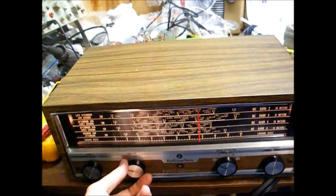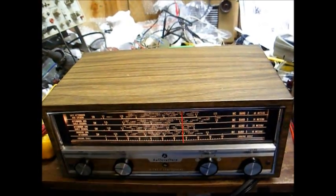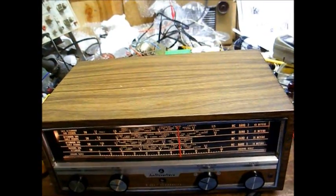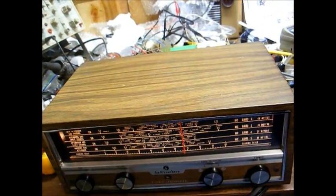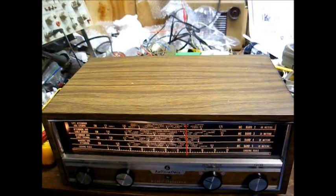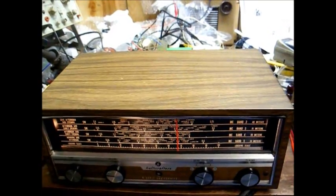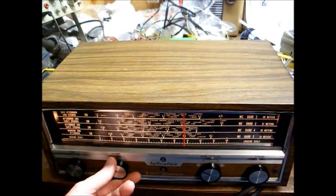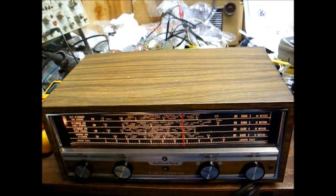There you go, that'll about do it. I wouldn't call this a restoration — this was more of a repair. We replaced the dead filter capacitor, cleaned the controls, and just for safety we replaced the selenium rectifier with a 1N4007 silicon diode, and we replaced the capacitor wired across the AC power line. Maybe one day I'll do the other capacitors, but it seems to be working okay, and the later capacitors in these units didn't seem to give the problems that the older ones did. Thanks for watching, and more to come later.